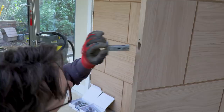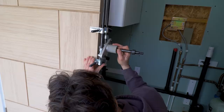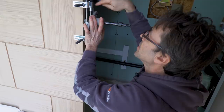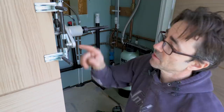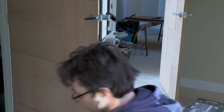What's really nice about that is it's the exact size for the latch so it's not too big. I'll also use this on the slave door - this is relative to the panel which is the centre. Line it up with the bottom hole and clamp the bottom off, then do the same at the top. If you've got a lot of repeats to do it's got this handy little clip which you slot down. When I did the rest of the doors I went around and did all of these first, then changed it for the face plates. We don't use the black keeps - we just make a nice neat keep in the timber. So we've got the face plate cutter, clamp them off, and set the depth stop to suit the latch end and the face plate.